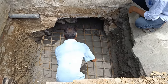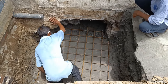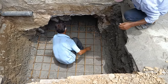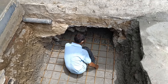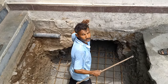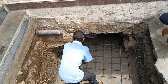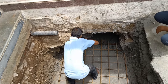They are just placing the mesh on the PCC bed. While placing, you can see the corners of the rods are touching the ground. Whatever the rods which are ending — those should not touch the ground, meaning the mud. So for that, what we are going to do is make it L-shape.